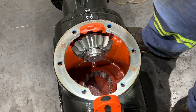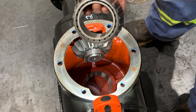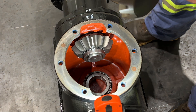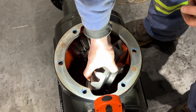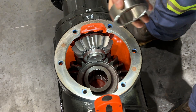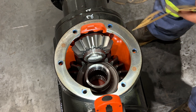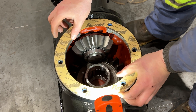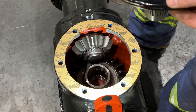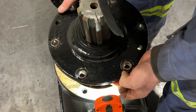It's time to put one of the output shafts back in — I'll show you the part stack and the order in which it all goes back together. We're going to start with our bearing — drop that back in there and make sure it spins freely. Next we're going to take our big old gear here and drop this down inside, make sure it lines up. Very important — can't forget the washer or the spacer. Drop that in there. Next is going to be our gasket; when I took this side apart only one gasket was there, so that's what we're going to put back. We'll try and make sure that those line-up marks we put on there at the start still line up.